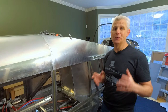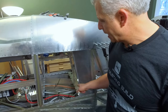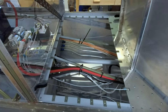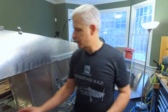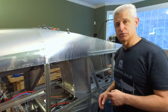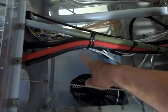When we talk maintenance access, which is so much of a priority for all the work we've done, you get to this section. We've still got some cables and wires to tie up, but this whole panel comes out. This is normally a floor of the aircraft, and there are two levels to it. The first level is where you can see all these wires as well as the relays that control the electric trim, smoke system, and so on. We also have a cable for our belly scoop air exit door, which controls the cooling of the aircraft.